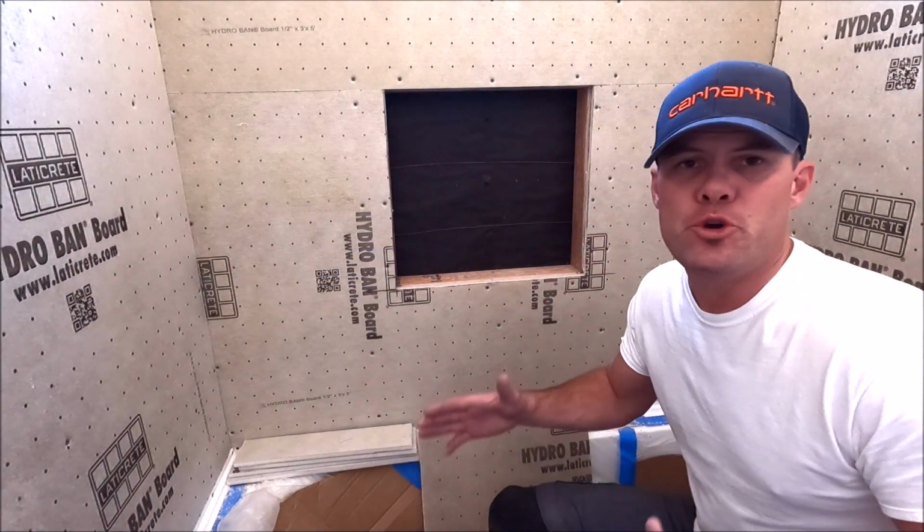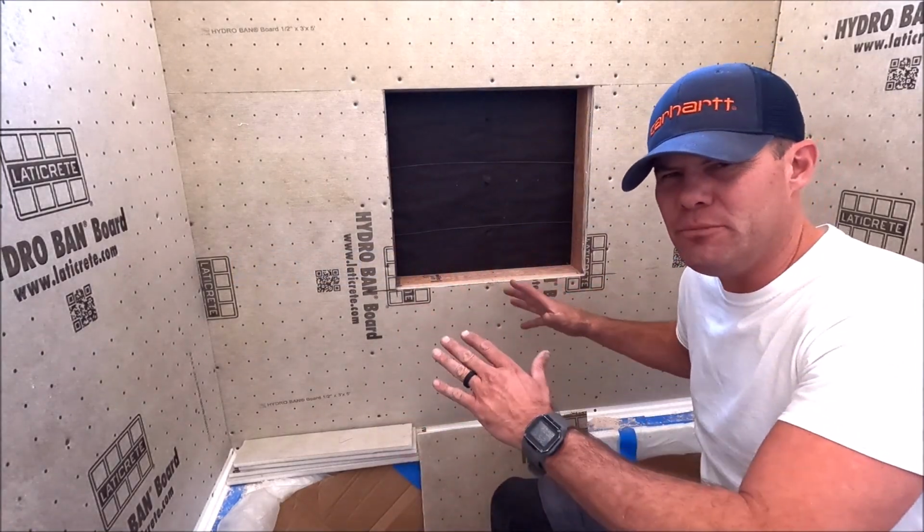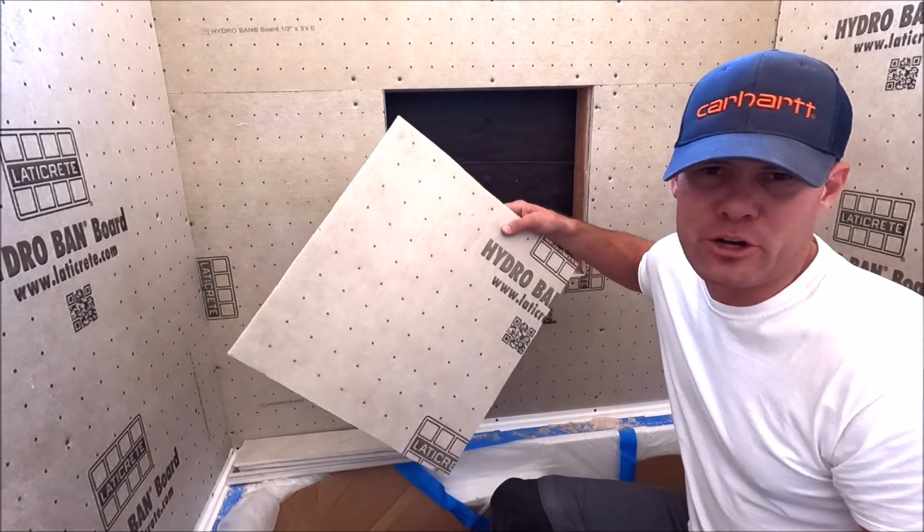In this video, I will show you how to build a custom niche using LATICRETE HYDRO BAN board. But first, we need to make up half of an inch. The way that this house was built and the drywall was installed, we need to shim all of the framing half of an inch, so when we install our HYDRO BAN board, it is flush with the existing bathroom drywall. Quick and easy way to do this. Let me show you how.